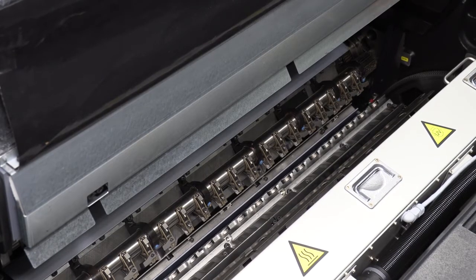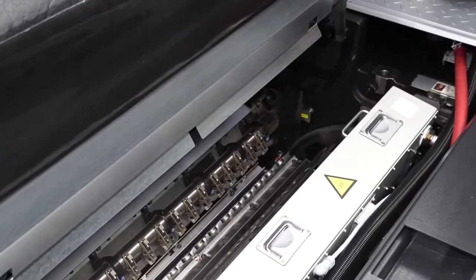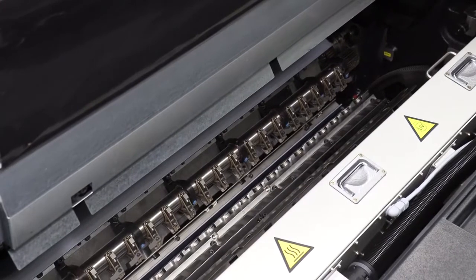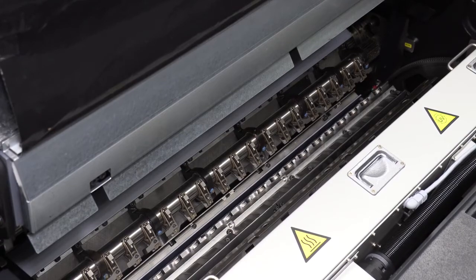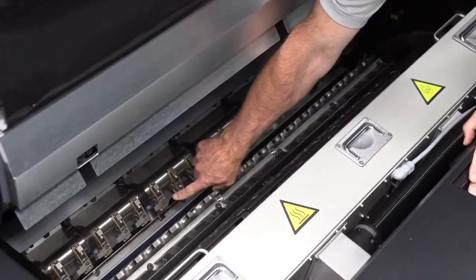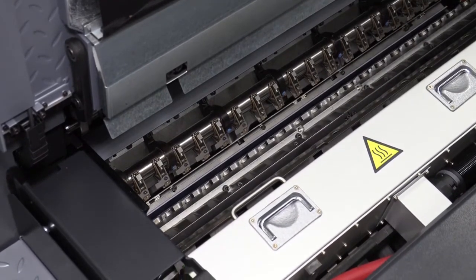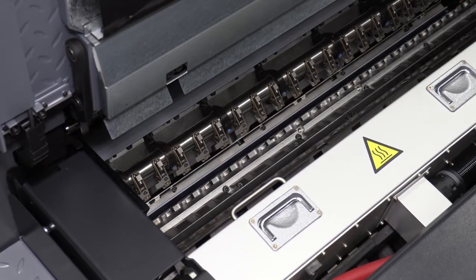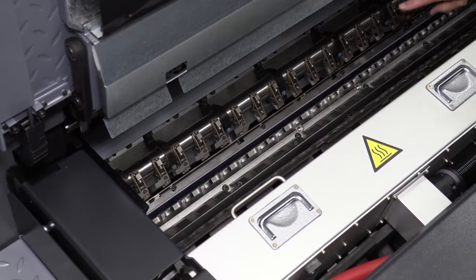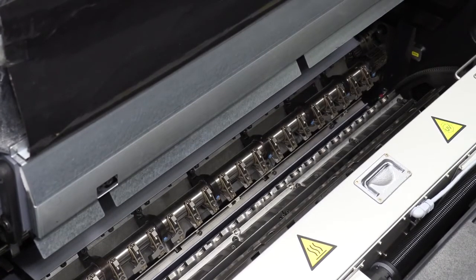So what have we done? We've done some enhancements here with reinforcing the grippers. It's 50% higher gripper force. We've made enhancements with modified air settings. Again, coming onto that off the storage drum into the pincer bar gripper. On the very ends, we have a wing gripper system as well. So when we run some of those smaller sheet sizes that might fall in between the grippers, those can now help control the sheet as it goes into our variable eccentric drum here. Along with that, on the cylinder itself, we have a refined cylinder jacket, again, to help enhance the quality of the print.